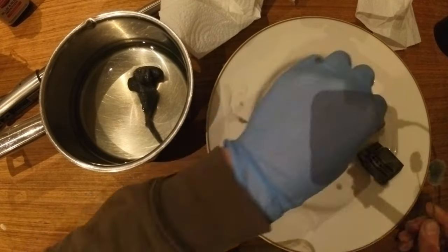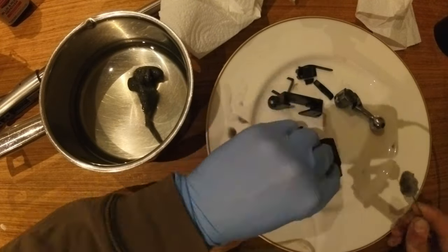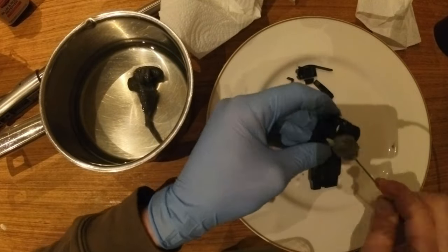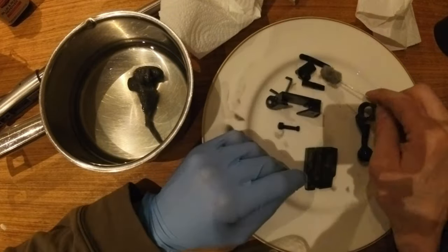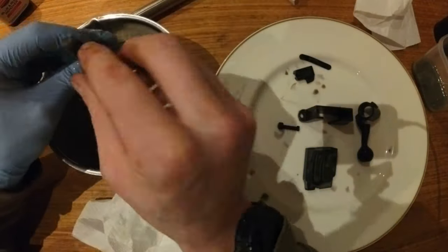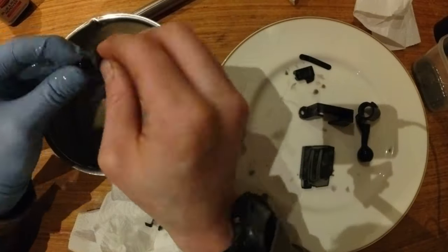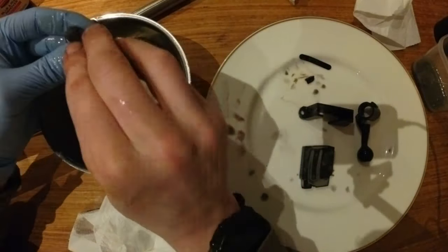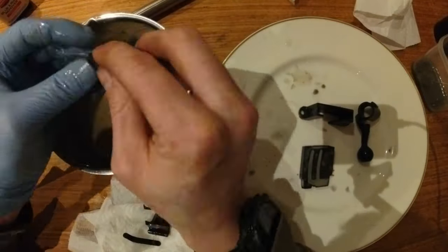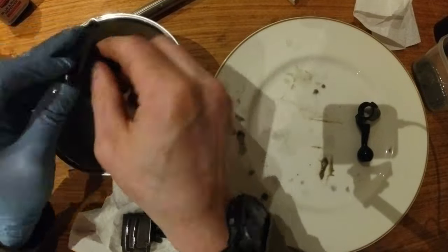I've also had the same luck with two coats as I have with sort of four or five, and I think the main thing that will make a difference is the amount of prep that you do beforehand. I mean, remember, 95% of anything like this is in the prep. I've tried bluing parts that had no original blue on, so completely bare steel, and parts that had a mix of bare steel and original blue, also with not much difference. I mean, remember, this bluing solution you can use as a touch-up.